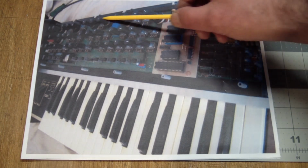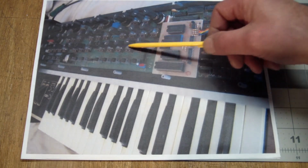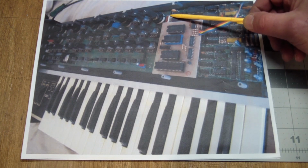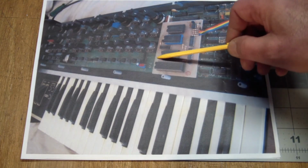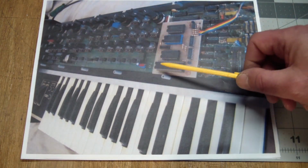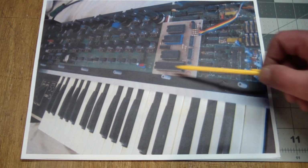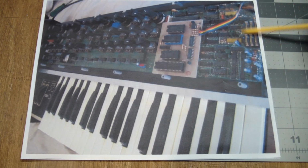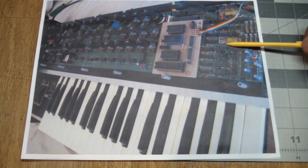You can see here's all the pots. It's got basically two PCBs with a big interconnect, which you can kind of see peeking through here, which is the Achilles heel of it, because this always goes bad and the thing acts weird. But you get all these pots soldered to the PCB. A few ICs interspersed in here, but buttons, and of course the pots that came through the front panel. And on this side was the CPU and the sound generating circuitry.